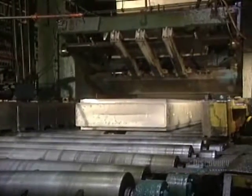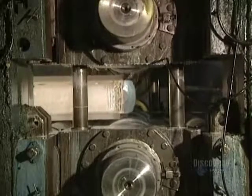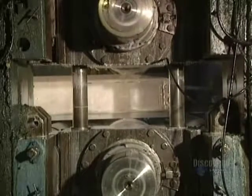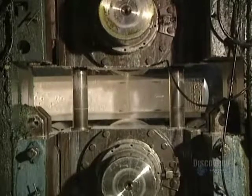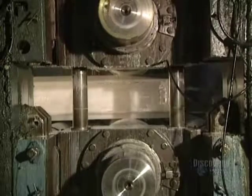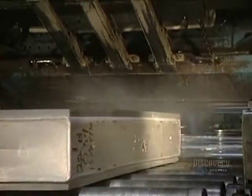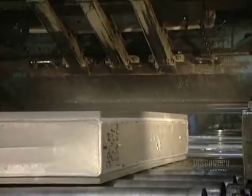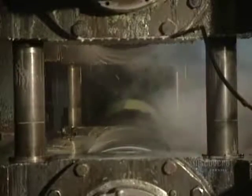The many steps in the thinning of the ingot begin. The aluminum block is crushed by the hot mill rollers. Temperatures in the rollers are between 455 and 540 degrees centigrade. Pressure on the ingot is continually verified by a technician; if too great, it's lowered and adjusted. The heat is so high that the ingot risks sticking to the mill's roller. To prevent this, everything is cooled with a liquid that's 95% water and 5% oil.